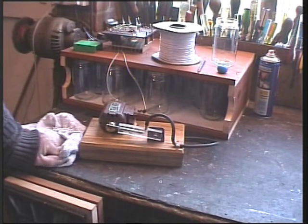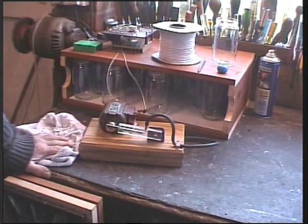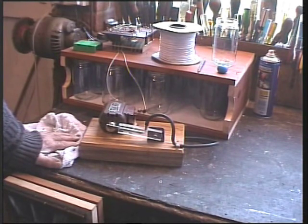So I looked on YouTube to see what I could find. There's an awful lot out there. And then I decided that a popular form of assistance is the pulsating air engraver, which is nothing more than oscillating pressure of air acting on a small piston in the engraver body that strikes the end of the engraver. I looked at a few vibrating types, buzzer types. I thought the air seemed to be the idea — something like a miniature jackhammer.